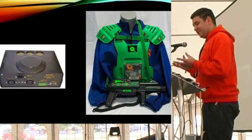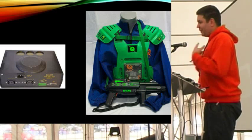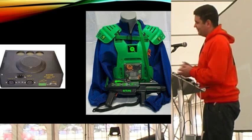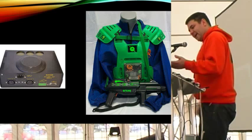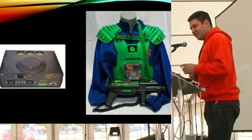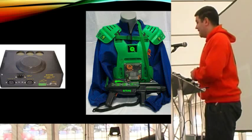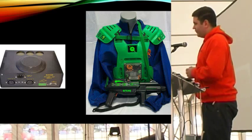It also allows us to do things like mines - you can create mines that make a load of noise and fire out and kill anybody near them. Or you can have bases - team aligned or neutral bases - and you go shoot the base and it makes loads of noise and sirens go off. On this unit there are a couple of power connections turned on and off depending on the game. There's a little D connector which goes to a scoreboard for electronic digits showing the scores, and another connector is the network connection linking back to the game computer. There's also a little audio jack for a big external speaker.